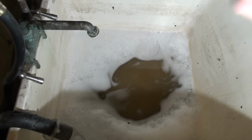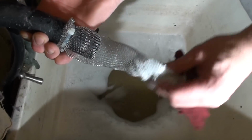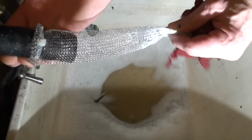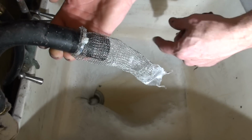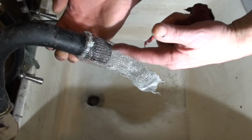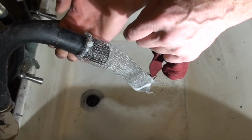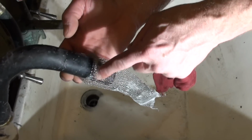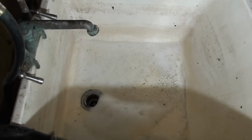And one other thing we did for this homeowner here is on her washing machine drain that goes right into the slop sink, we put one of these lint socks on there, which are available in home centers and hardware stores. It just catches like 90% of the lint so it doesn't go down the drain, especially if you got a cesspool and stuff. I mean, this lint just builds up forever, and after like 20-30 years it's just totally coating the inside of your cesspool. Also gets caught on rusty debris spots in your pipes and can make a clog, and it goes on with a cable tie, and that's that. Alright, so that went down.